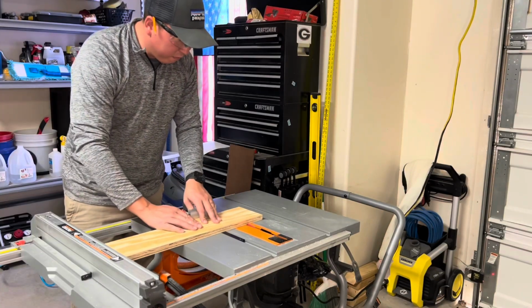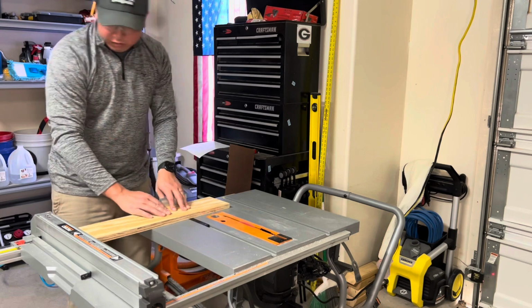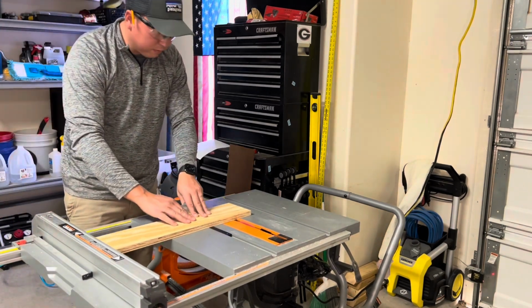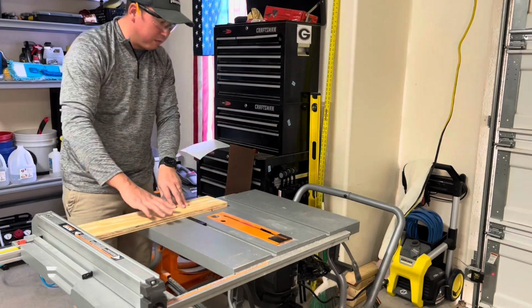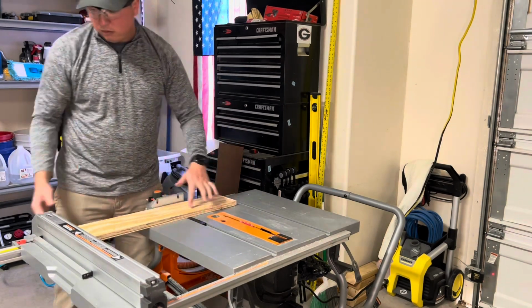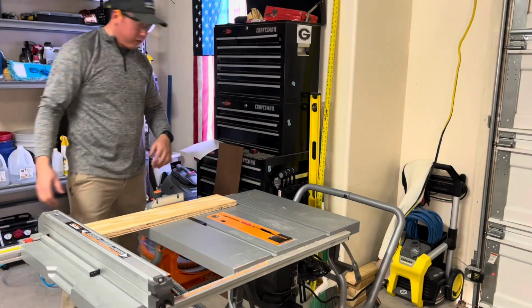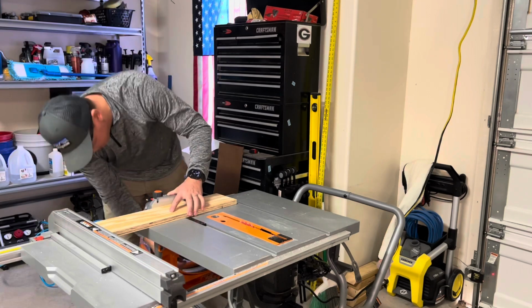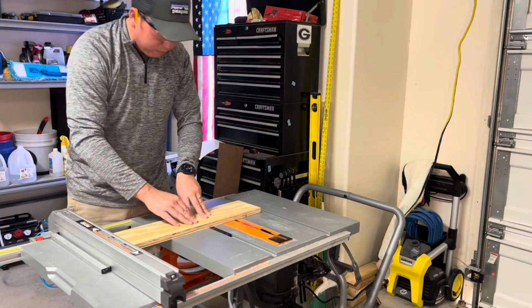So the last main thing that we're using the plywood for is to build a little shelf in the back here to hold sandpaper and some miscellaneous stuff. So you see me cutting a dado here for some little 1/8 inch thick material that I have. Do a quick test fit, bump the saw over, and then run a dado through.